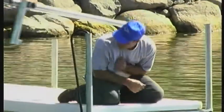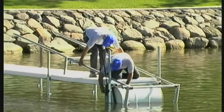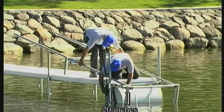If only one person is available to carry a 16-foot frame, you will need to find the balance point approximately 21 inches in front of the center continuous bracket. Notice the installer in front will drop down as the framework will be set down approximately 20 inches past the existing frame and in between the vertical pipes.